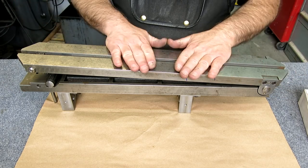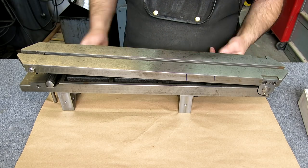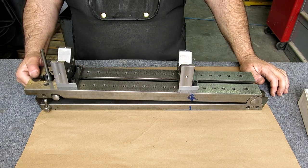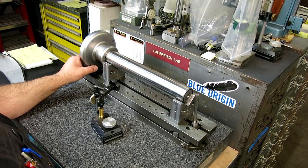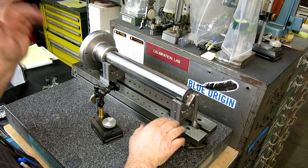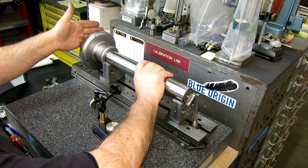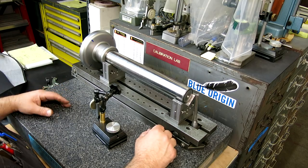Okay, so I'm going to take this over on the surface plate. We'll get it set up, and then we'll measure the pin and see if it's parallel with the base. Because I didn't take any super special care on making these V-blocks. So, because I figured I can always adjust with this a little bit if I have to. So, okay, so you can kind of see how we're going to grind this here. This will go up on the surface grinder, and it'll get counterbalanced. And I've got all that worked out, so you'll see that in a minute. And then we're going to side wheel these little feet here, right up in this area. And I'm just going to hand rotate this. I got a little end stop. So you'll see all that coming up, just kind of explaining ahead a little bit.